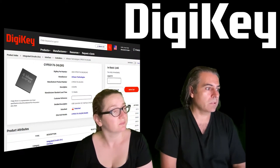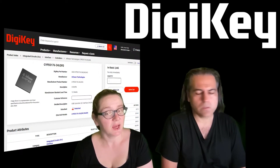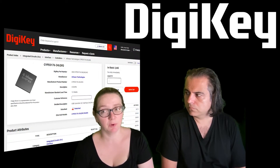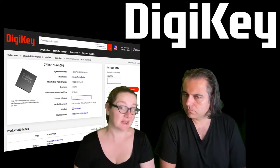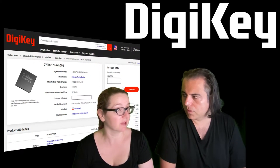I'm thinking about making such an adapter. Yeah, I think that's the VBUS min and VBUS max. I think you can set it so you tell it, if you can't give me 15 volts, don't give me 12. You're right, it's not uncommon for USB PD sinks to just go to the next lowest. But the next lowest may actually not be good for your device. You can tell them, don't do it.